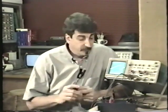So when do you need an oscilloscope? Well, there are times when you must have an oscilloscope. If you're going to be working on digital and microprocessor systems, you're really going to need an oscilloscope. And this includes video games, pinball machines, vending games are now digital, redemption pieces are digital, bill changers, bill acceptors have little digital boards in them.